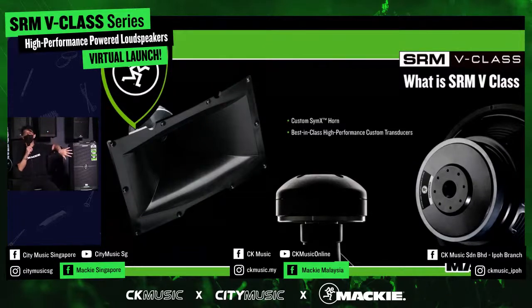The design of the horn also creates a very perfectly symmetrical response at the crossover point, and that gives you a very smooth mid-range. And the horn loading frequency is actually set below the driver's low-frequency capability, and that allows you the maximum efficiency and performance. The speaker also has a coverage angle of 90 degrees horizontally, and 60 degrees vertically.